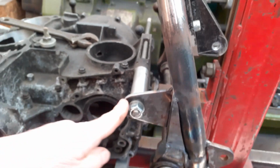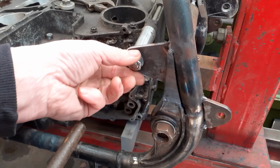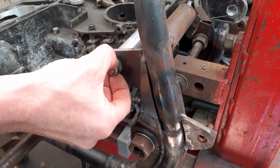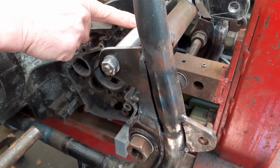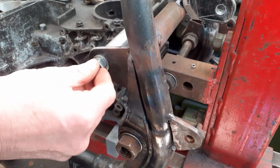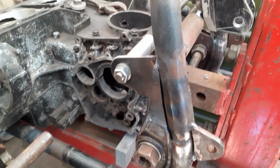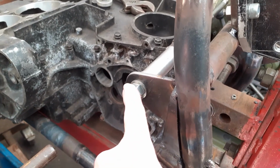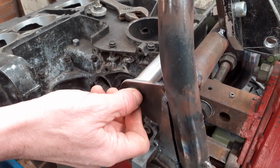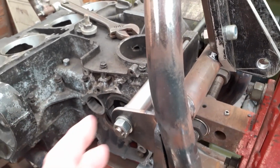Plus, the outrigger's going to come on this side. I'm going to make an outrigger. So look, that'll come on there. The only thing is the outrigger has an Allen bolt head rather than a nut. So whether to make the spacer screw on and have a thread in it and then counterbore the outrigger plate, and you'll put a nice Allen 12mm. Well, if a shaft goes all the way through. Yeah, but if you've got another plate there, half inch, then you've got a nut stuck out, and if you weld it and skim it, it'll look pretty cool.